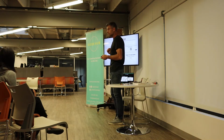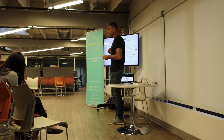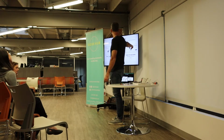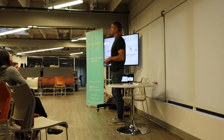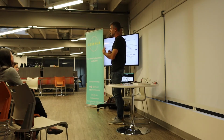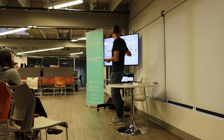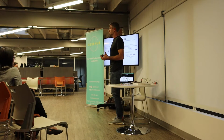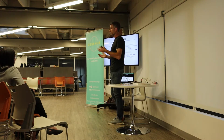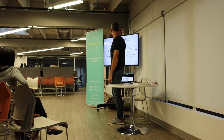Yes. So that has limit switches to determine when it's at the extent of its range. So it automatically shuts itself off. It does, yeah. You're right, this is a limit switch, and it tells itself not to keep driving in. Right, with a worm gear, if it didn't have a limit switch, it would just push the gear right off the end, and that would be a problem. So sometimes you get a simpler motor, and then you have to add your own limit switch or some kind of encoder to know. Or even, something spinning around, like the stepper motor I'll show you later, you want to stop it before it crashes into itself, so you have to add in some check.